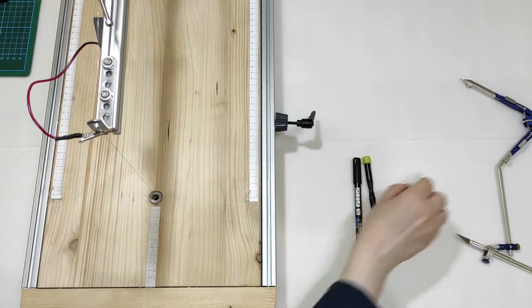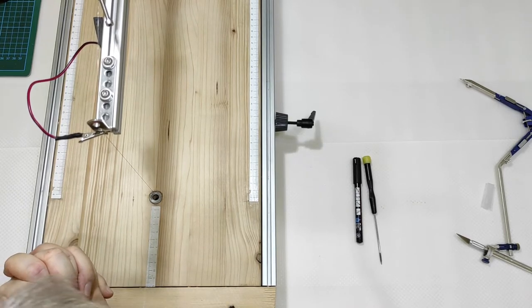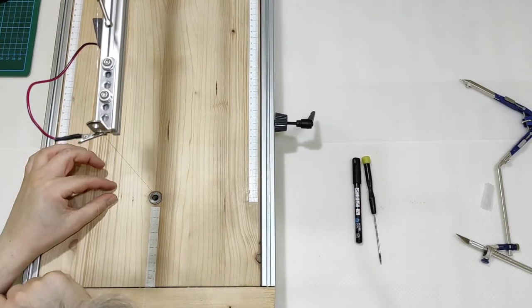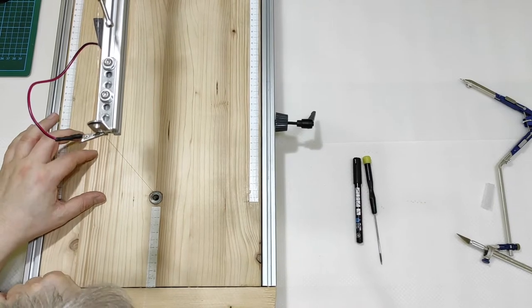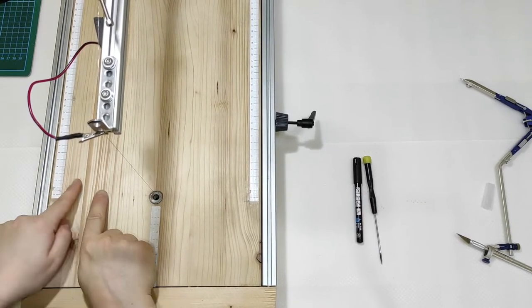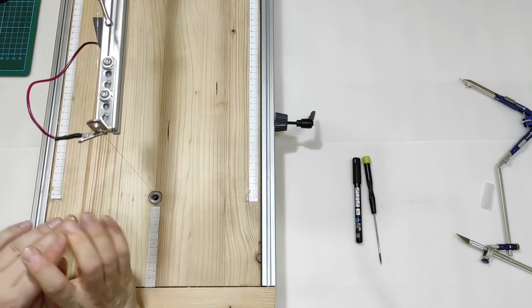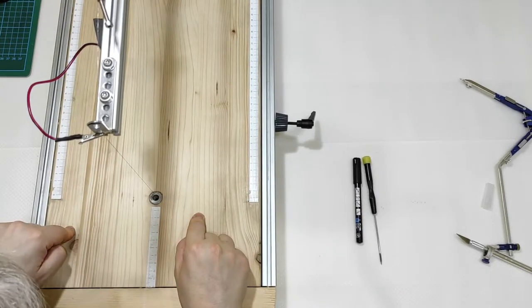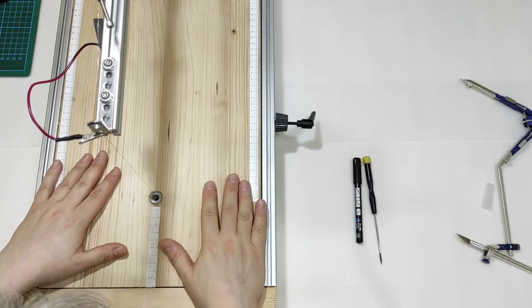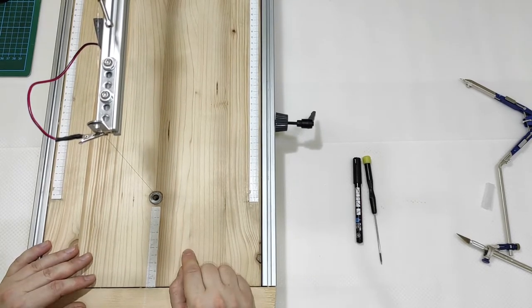I thought previously that my rings need to be 21 centimeters in outer diameter and 18 centimeters in inner diameter. So the ring will have a width of 1.5 centimeters, because 21 minus 18 equals 3, 3 divided by 2 equals 1.5, so 1.5 centimeters in thickness, the width of the rings. How will I proceed with this cutting table? You have seen me doing it in a tutorial last season, but I also have some jigs for this.